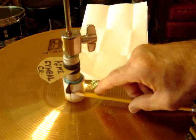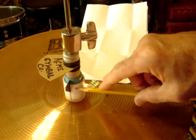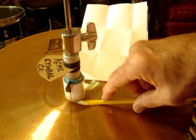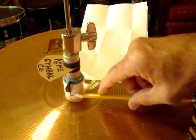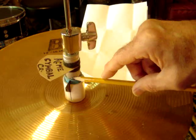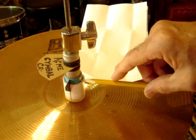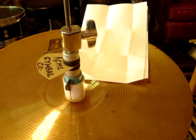To protect against overriding it, if I press far enough, this inner sleeve bottoms out down here and takes all the force. The flag is just free-riding, does not press against the end and is also not pressed against by the clutch mechanism itself. And that concludes this portion. Thank you very much.